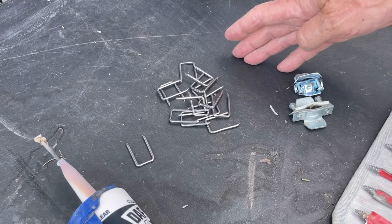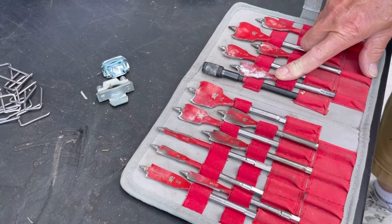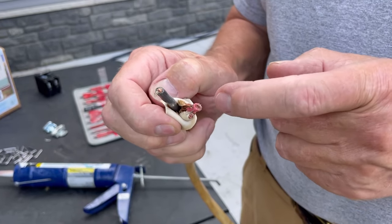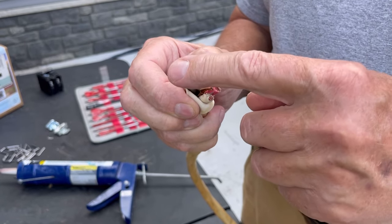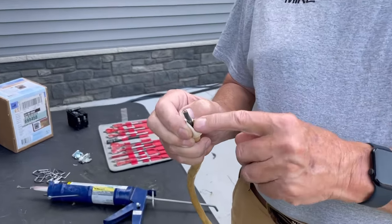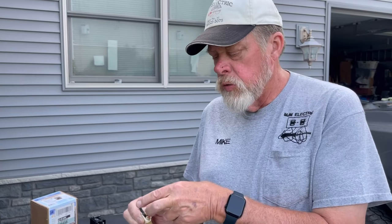You need to drill a hole through the wall and some caulk to seal it up. This wire runs $6.25 a foot — it has two hot conductors, a neutral, and a ground. You need all four wires to run the 50-amp 220 circuit. In a 30-amp 110 system you only have a ground, a neutral, and one hot. This 50-amp setup has two hots, a neutral, and a ground — each leg to neutral is 110, but the two legs together give you 220, just like at an RV park pedestal.